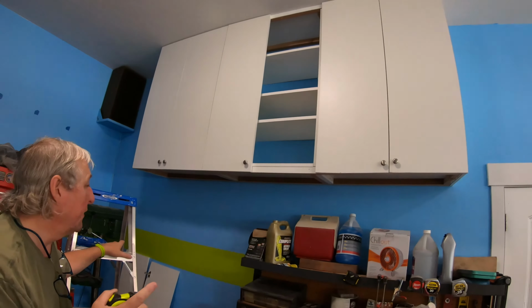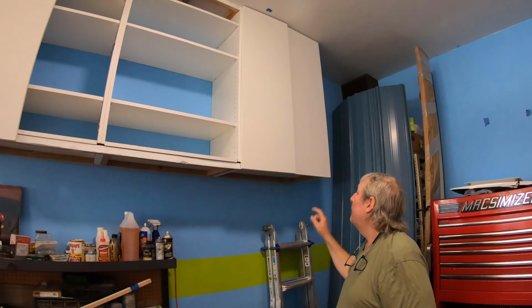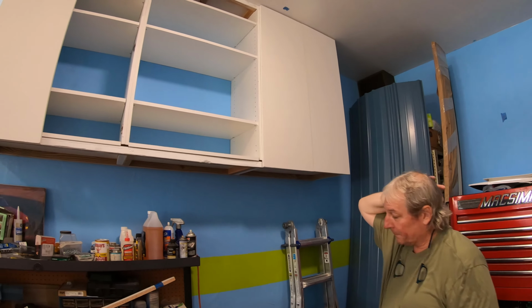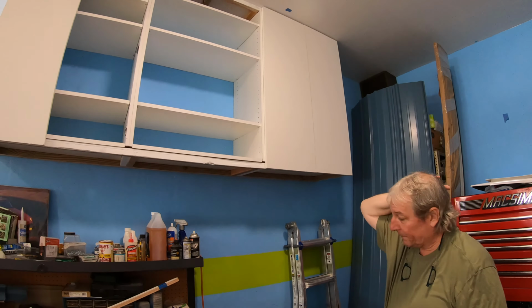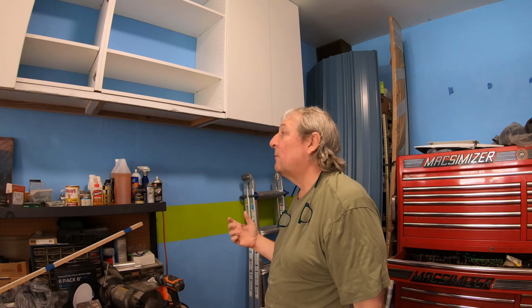As we've shown you previously, we've hit some snags with the doors not fitting right. On the other side over here, we did get this one done. We have not drilled it for the handle yet. And we've kind of been marking the doors that don't fit, and okay, what do we need to trim? And most of them we're having to trim anywhere from about a 1/16 to 3/16 of an inch off of one edge, sometimes off of 2 edges.